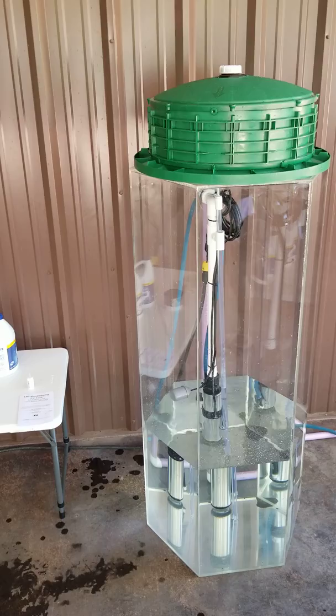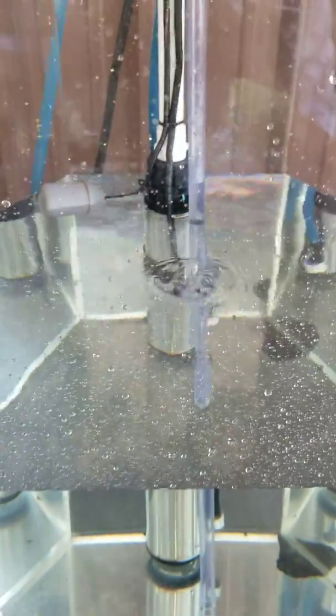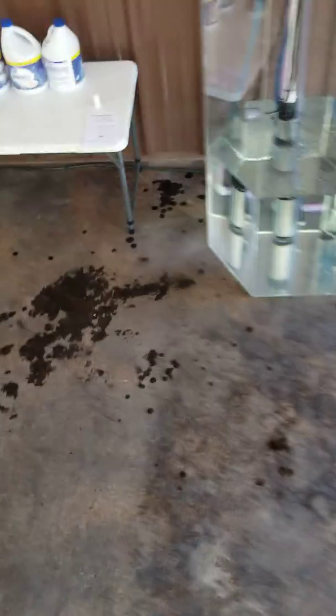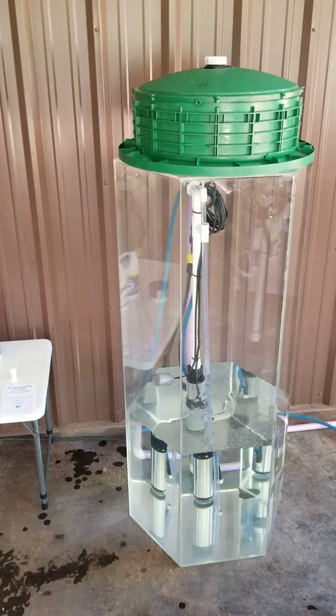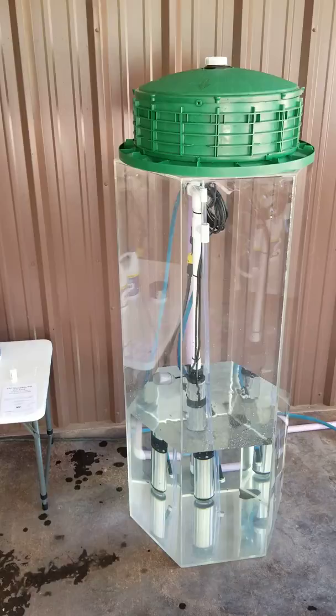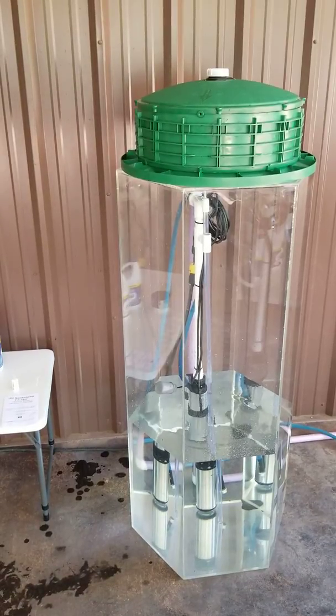As you can see now, the water level is climbing. The tank is adding disinfectant to the pump tank as the water level rises. As the water level comes up, we're adding disinfectant, which gives it the most amount of contact time. It's the absolute best way to disinfect.